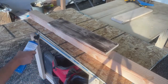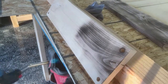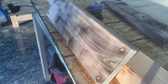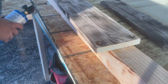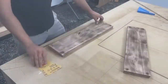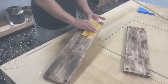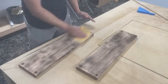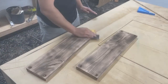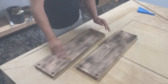I chose to do it because it's something I've seen a lot of other people do and it looks really fun and really good. The best advice I have here is to not overdo it — a lot of people do and they just completely scorch the wood, and I think it takes away a lot of the character. Then I moved on to finishing it up: I first ran over it with some 320 grit just to knock down any raised grain from the scorching, then ran over it with a paper towel. We already gave this a really good sanding earlier, so remember we're just touching it up and giving it some finishing touches.